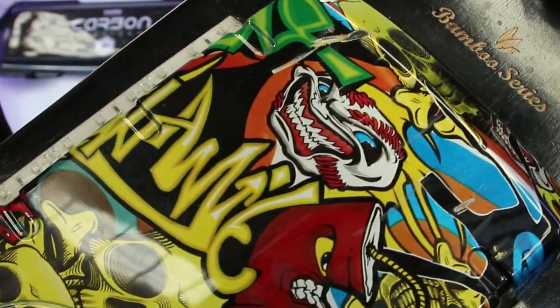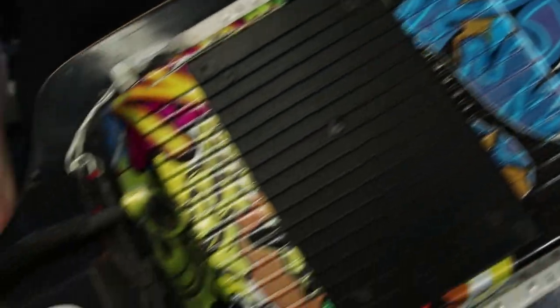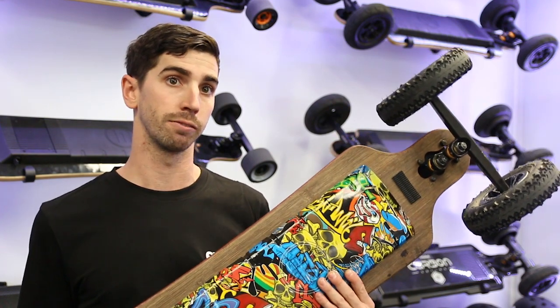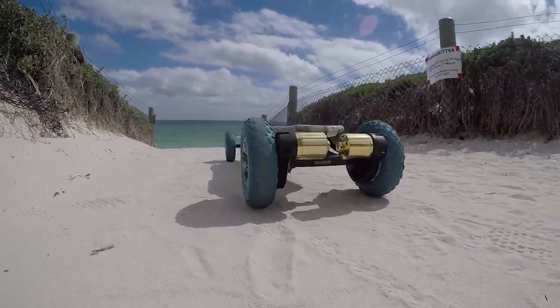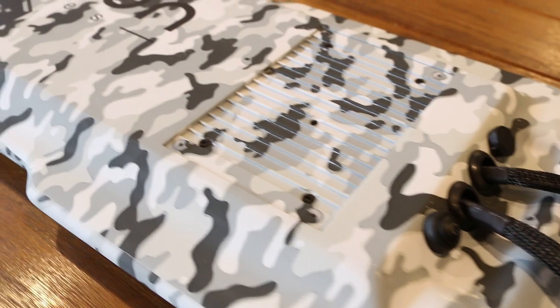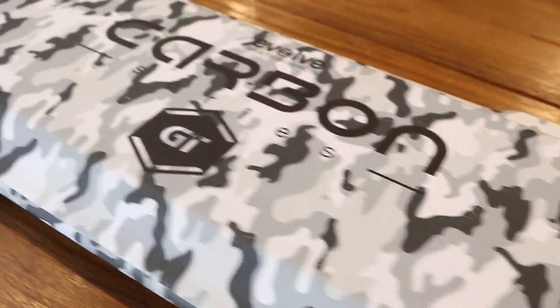As you can see here, this battery case has been Hydro Dipped. To do it, I had to remove all electrics from it — the motor controller, the battery, the switch and the charging port all had to come out, and the battery case had to be cleaned before dipping. I've seen two other boards that come to mind that have been Hydro Dipped: one was a Skull and one was a Camo Dip. It does give your board a really unique coating and often creates a one-off board.